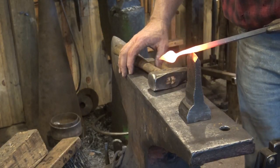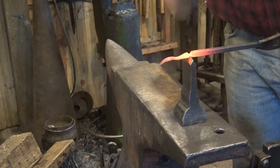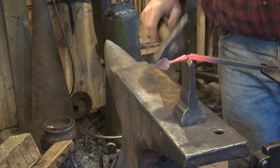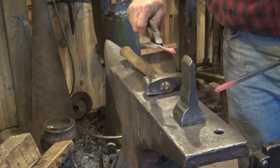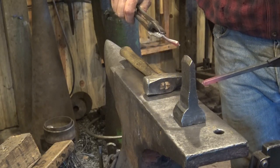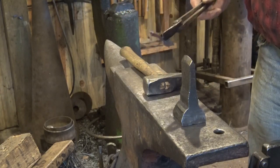So I'm going to cut this off probably at about an inch and a half — I'm not going to bother to measure it, just whatever looks about right. Now for some things you may not want to cut this off; you may need to leave the leaf on the end of the bar. There are lots of things you can do with a leaf besides just the standalone leaf — this could be part of a poker element or part of a fancy fork or spoon handle. So if you don't need to cut it off the bar, leave it on the bar. But for this, we're going to cut it off and then draw that stem out.